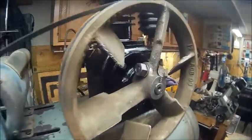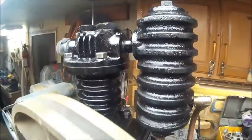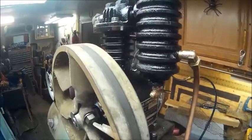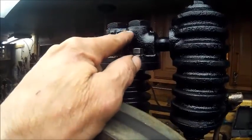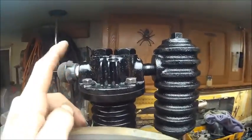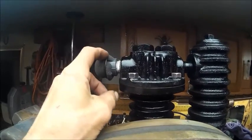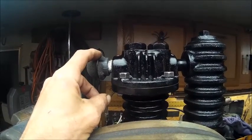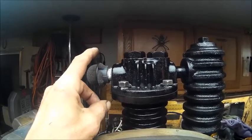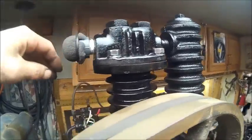Here is the new and improved pump. Let's just hope it's fixed — I cleaned a bunch of walnuts, rust, and debris out of the area of the reed valves. I still haven't figured out how walnuts got in there, unless somebody had this off at one time and left it open for a while, and either wind blew something in or — I don't know. Still trying to figure out how that happened, but walnuts were underneath this right here.